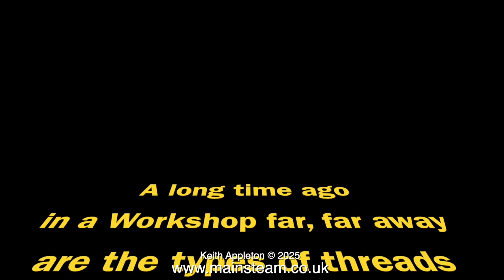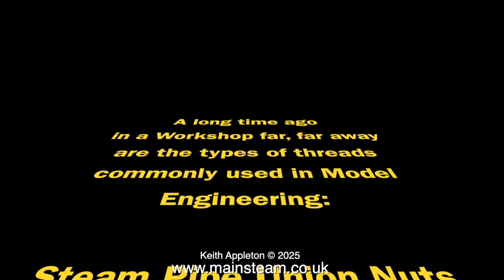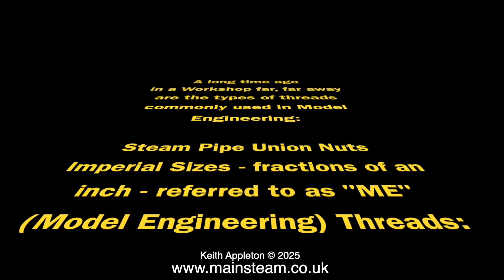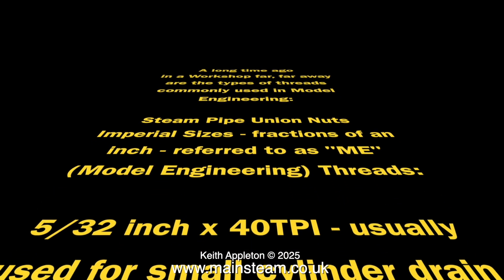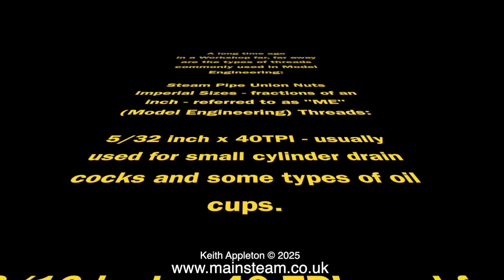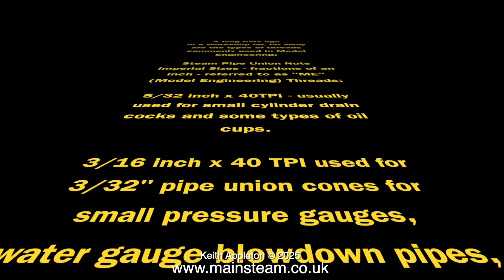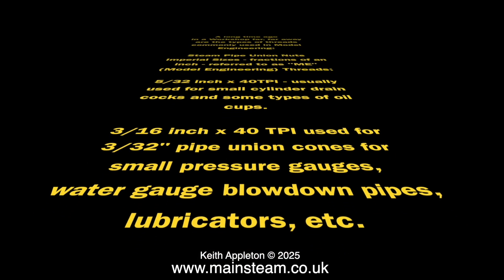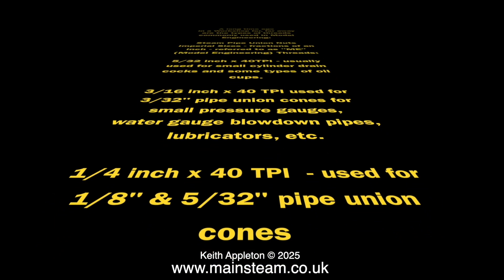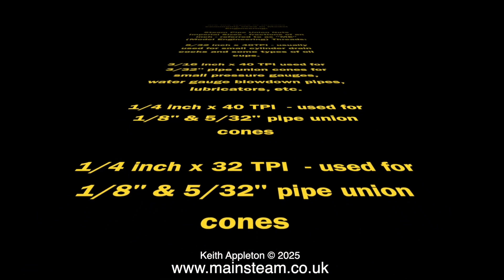There's a lot more information about taps and dies on the internet, and there is an eBook I put together a few years ago available for Patreon supporters to download for free. Scrolling up at the end of the video is a list of very popular taps and die sizes. The golden rule for threading model engineering parts is not to apply too much pressure and to back off the tap frequently to clear the chippings. Don't forget to use tapping lubricants — there are different ones for different metals, but I generally use my steam oil and rapeseed oil mixture, which works very well.